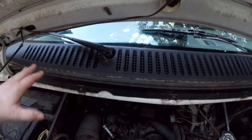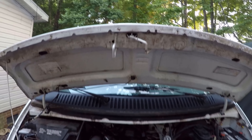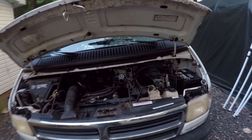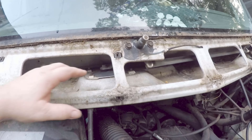The second clue is that the wiper arms move freely on their own, which they shouldn't do. So what we're probably looking at is some broken linkage or a broken bushing. The next step is to remove the cowl. To make that easier, I'm also going to pull the hood off — it's a really small hood and easy to remove.